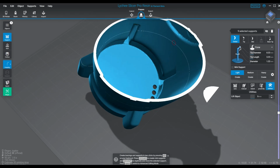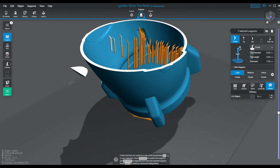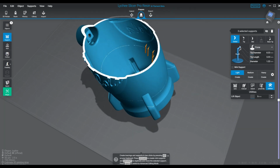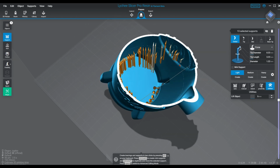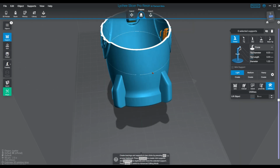Now for heavier parts, torsos, bottoms, bases, you know, hollowed out chunks like this where you have a giant piece, terrain parts, no. Definitely don't shrug on that, because you're going to need to support the areas that are going to come straight across. You're going to need to support anything that is a yellow area on the inside. And yes, the smaller parts may have those zones too, but always remember, do your islands check, make sure you support those islands, and then you should be good as far as the areas on those models that you need to support. But we've just found that it isn't always necessary to over support the inside of a model. You can sometimes get away with just going islands and then done, and not have to worry about anything too heavy on the inside.